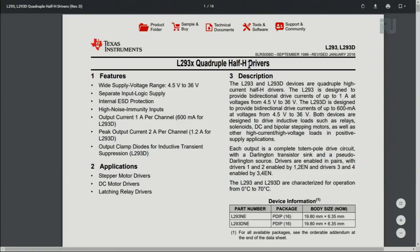This is called a quadruple half-bridge. Every time we mention the word half bridge or full bridge: full bridge means you are able to control a motor in two directions. Half bridge means you can just turn a motor on and off without controlling direction. This being quadruple half-bridge means it has dual full bridge, so it can control two motors fully — both clockwise and counterclockwise — across 4.5 to 36 volts.